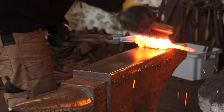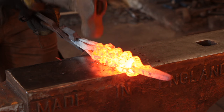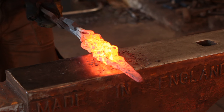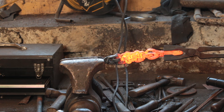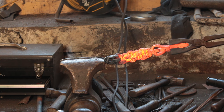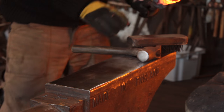With both sides welded up, I'll start dressing it a little bit, making sure everything is nice and even and the braid is even. With a gas torch I could have done this a lot tighter and neater. With everything dressed, I'll go over to my swage device and pull it out a touch — that will give me the seven inches I need and even out the braid. I cooled off the bottom end because it was a bit loose there already.